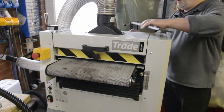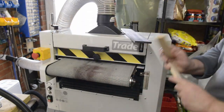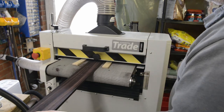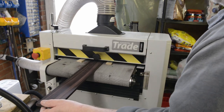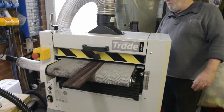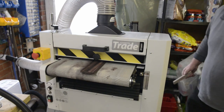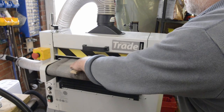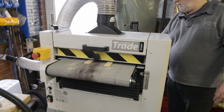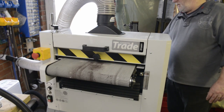When I got back to it I had the same problems again despite taking a lot of time to make sure the belt was properly installed and tensioned. I spoke to technical support at Axminster who sent out one of their engineers to take a look. The main points from his visit were that he thought my dust extraction was inadequate and the build-up of dust could be causing the issues; that to attach a new belt it was necessary to trim the ends of the pre-cut belts bought from Axminster both for length and width; and that it may be better to mount the board on a sled — although I was not convinced about this as the board did not rock on my workbench.